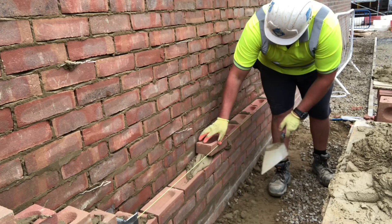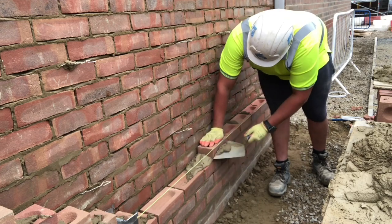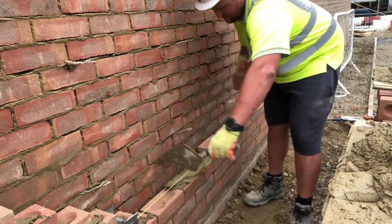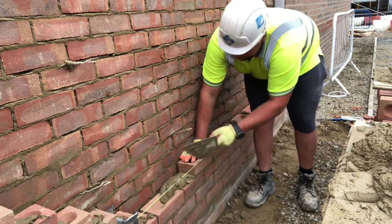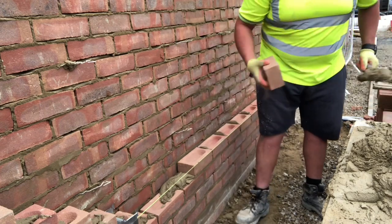If you do an 11-course and run in, you're mixing it up — you're not getting sick of corner building before you're running in, and you're not having to rush lining in part of the brickwork. You get a bit of a true reading because you're making sure everything lines every 10 course, which is nice.